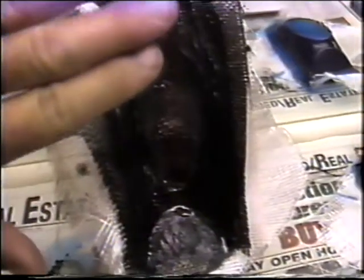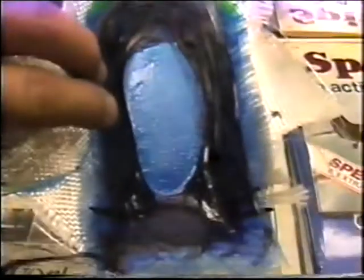Now, one of the things I did yesterday is I put the mold, now you can see if I can get in close on this, I put the mold vertically. Let's see if you can just get a reference of where vertical is here. I put it vertically so that all the extra resin tends to run down and into the extra little grooves, or whatever you want to call them, where we would expect an air pocket might happen. Now, looking at, I don't want to pull this one over, but that worked out real well on this one so far.